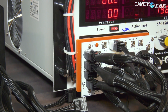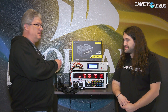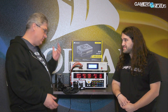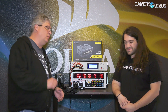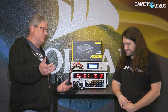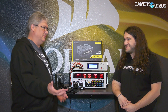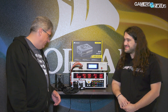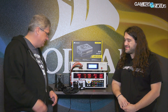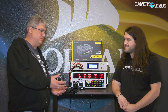A lot of what the power supply could do was also out of spec for what Intel expects your power supplies to do. This goes back to like 15 years ago, when a power supply that had 150 millivolts of ripple on the 12-volt rail was not uncommon — if you're paying like $20 for a 500-watt power supply. So I got a load tester and started loading up power supplies to whatever the label said, and blew quite a few of them up.